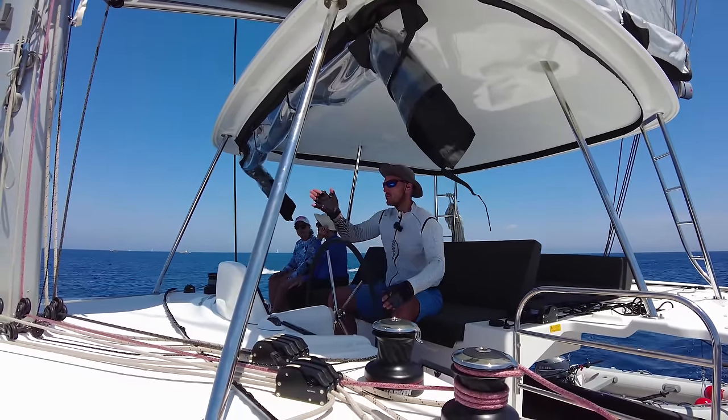So now I'm going slowly forward, but with the engines, not pulling the boat with the winch. I'm using the engines to move forward and just take up the slack. From here, I don't see really well what's going on. So the person in front is vital to help you, but with experience you kind of figure out how it works. But be careful not to put too much chain and then hit the winch. You have to go in with the hand and kick it.